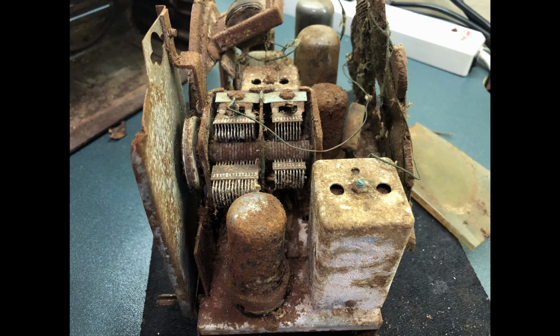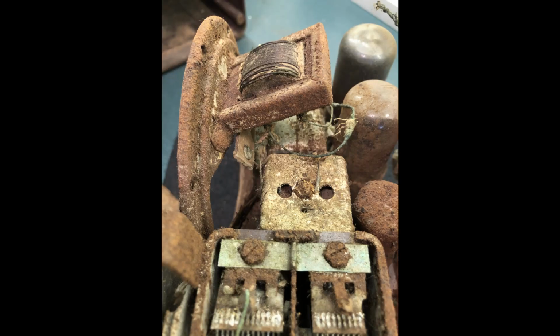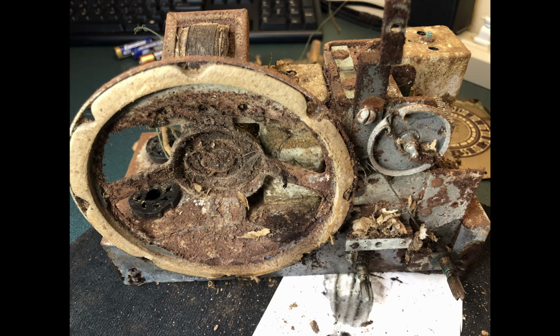Repair the IF cans, or they call them transformers. There are two of them. I have to take them apart to see if they need repair or not. Then the other thing that is just a big mess is the antenna coil. It is in awful condition. Then repair the speaker transformer if it's repairable, or replace it, and also the speaker. I'm going to try to learn how to totally restore a speaker. Hopefully it's going to work. Hey, we never know until we try, right?